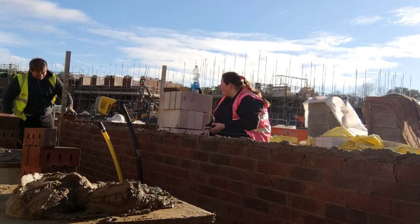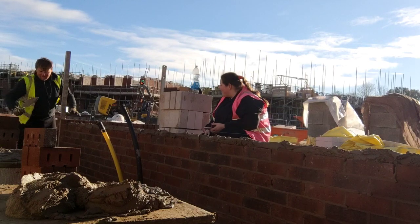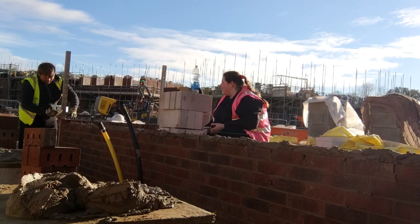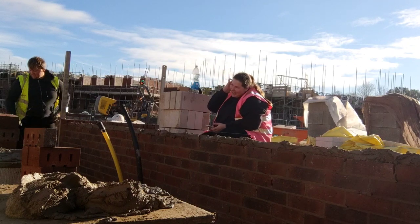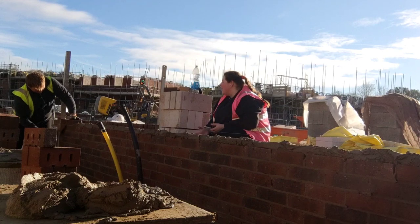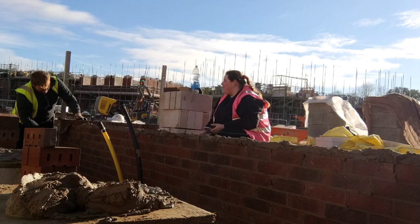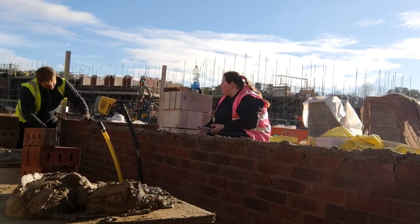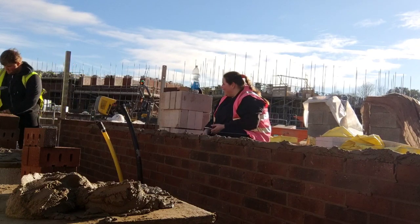A lot of people aren't privy to moving lines up — they push against the profile to move the line up. I could put a timber clamp on these profiles to stabilise them more, and I have done before. These profiles I'm using at the moment are really minimalist — they only reach 21 courses. With these concrete bricks I can't comfortably reach any higher without it coming over on me in one day, so 21 is the height I've limited myself to.